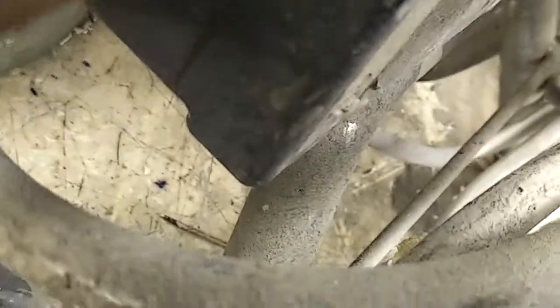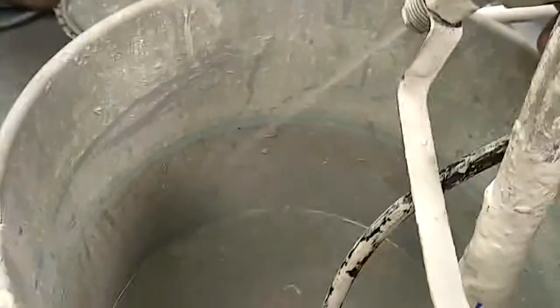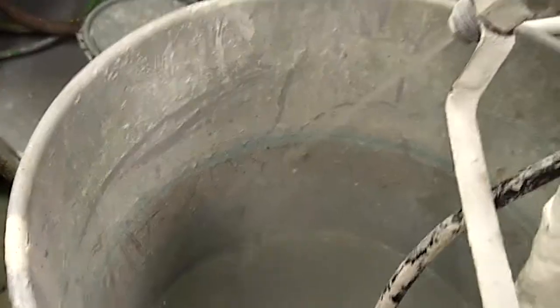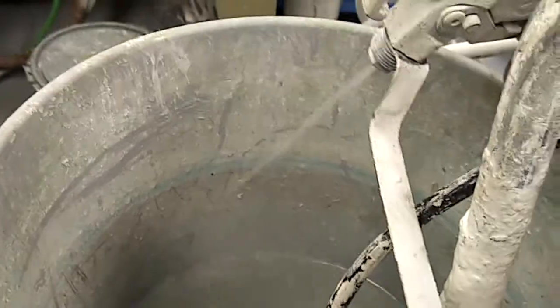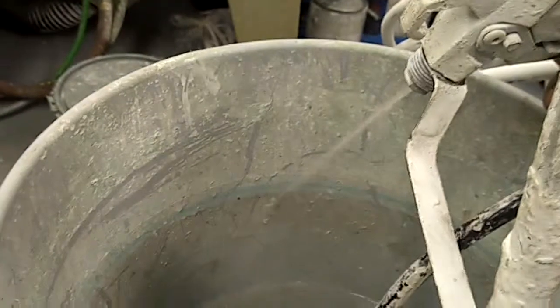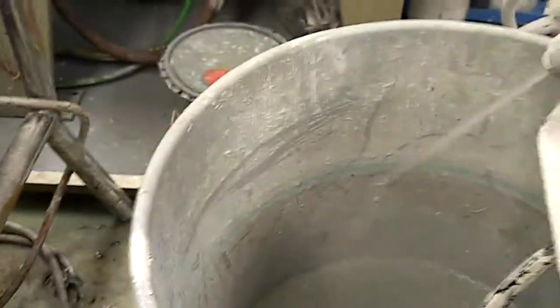Now I have to do it off the gun. We're going to flick it to pressure mode, and then we're going to shoot everything out of this line. You might get bubbles, you might not. You'll definitely feel a change in pressure — you can kind of feel the fluid rushing through the hose because it's vibrating. If not bubbles, then a noticeable change in flow. Now it's just trying to push the air out, and it's vibrating. The air is gone.